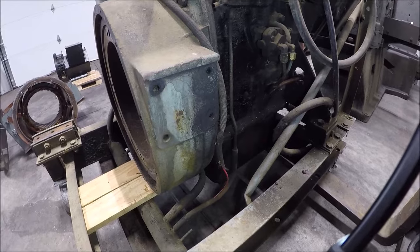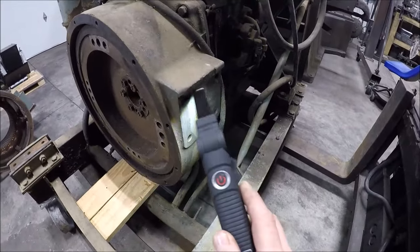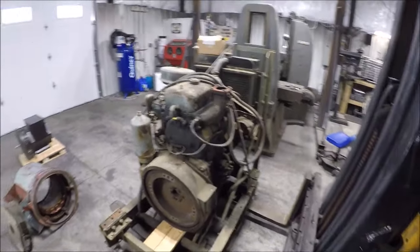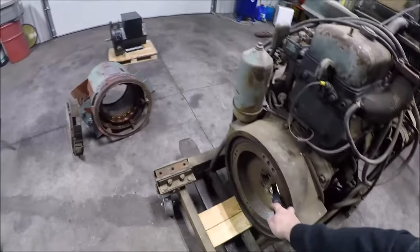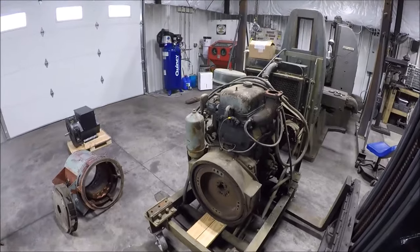I think the plan of attack is going to be to move these pads here, make some sort of brackets to come off of there and mount to here — that'll get the engine stable and at the right plane. Then we've got to figure out how to mount the new generator, and we've got to build some sort of adapter shaft coming off the back of the flywheel to the generator itself. Lots of different things to do — should be a fun project.